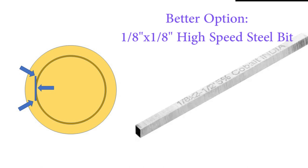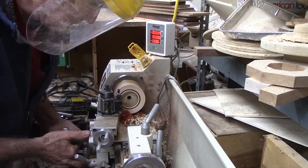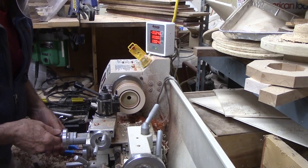Instead, I found a piece of 1/8 inch square high speed tool steel. I planned to insert this bit into a handle until I realized that the metal lathe could do it faster and easier. The metal lathe excels at straight work. This bit is available from machinist suppliers - I found it at McMaster, Grizzly, Amazon, etc. I also ground relief off the bottom corners to allow for the kerf curve. Back at the metal lathe, that same bit is in the tool holder. The lathe gears make easy work of parting off the innermost ring, then out for another and another. Sweet - 4 rings. I probably could have only gotten 3 from the metal lathe. The bit is very small, so I proceed gently to prevent the bit from breaking.